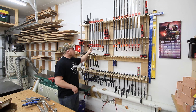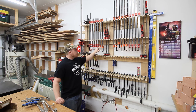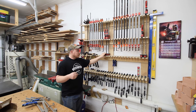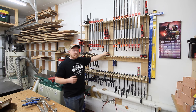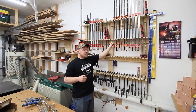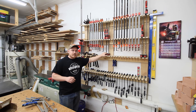My larger clamps are a mix between aluminum bar clamps, half-inch pipe clamps, and these Bessey K-body clamps. My favorites out of all of these are the half-inch pipe clamps. The Bessey K-body clamps have a lot of clamping power and a nice wide clamping face. Things I don't like about them: any glue squeeze-out that gets on the bar is a pain to clean up. These half-inch pipe clamps and bar clamps clean up very fast and easily. So I don't like the K-bodies for that. Also, these are big, heavy, and expensive.